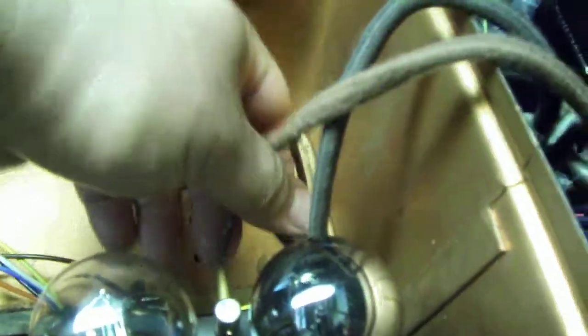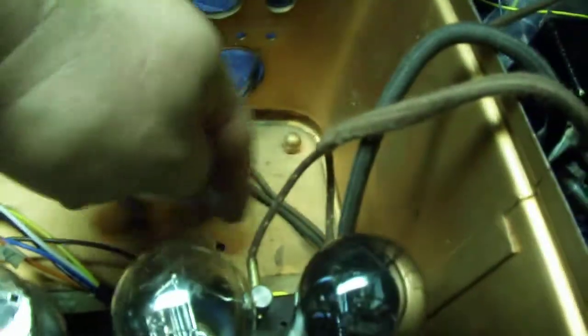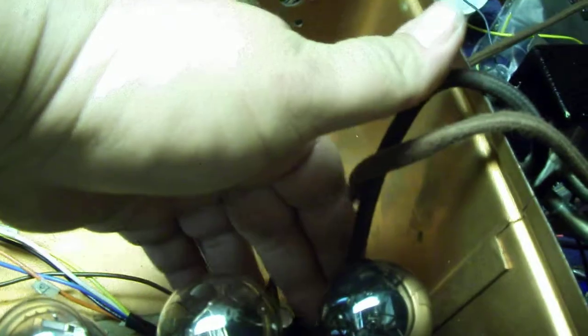The only thing I didn't have is a choke. The speaker up here — the cone usually goes bad — so you mount a regular speaker with an output transformer, and that's bridged across here. If somebody was to put a horn speaker in here, they'd have to mount a choke right here in series with the pins, so they wouldn't have a distorted sound.